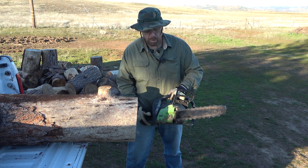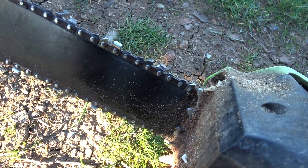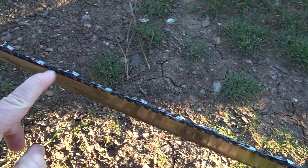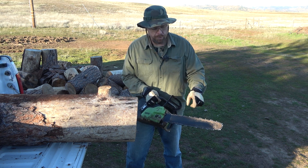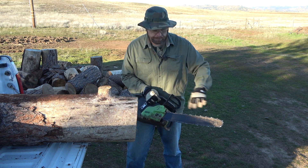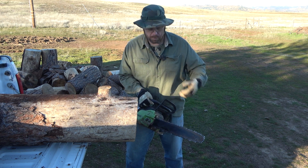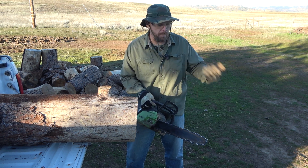Something about this chainsaw: I really like the pro chainsaw from Greenworks because it has that metal bumper grip on the front. I also replaced the chain — it's used, so not as sharp as out of the box, but it is an Oregon chain. The reason I went with Oregon is that Greenworks had transitioned from the standard chain I first got to what they call a skip chain, which skips every other cutting blade. This Oregon chain has the full cutting blade, which makes faster cuts but less efficient ones — you'll use more battery — but you cut faster, and to me that's a great trade-off.